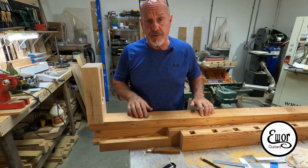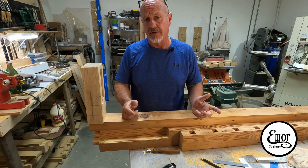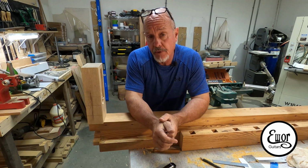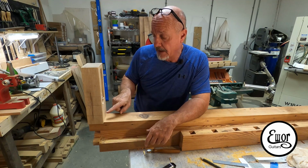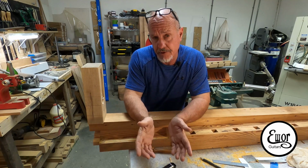This board right now is 1 3/4 inch thick and about 6 feet long. Very difficult thing to try to handle and cut dovetails in regularly. So I'm gonna do it on the bandsaw over there and then transfer the marks over to the end of the end cap and cut the sockets into that with my router. So router and chisels and stuff.